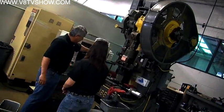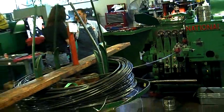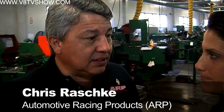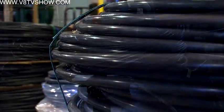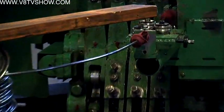The first room Chris took us to is filled with enormous loud machines — this is where the bolt process begins. These are bolt makers, also called cold formers. They take the raw coil material, straighten the wire, and then through a series of heads, they shape the head onto the bolt.